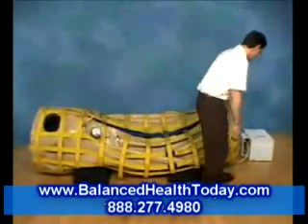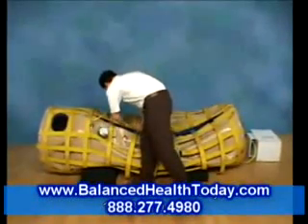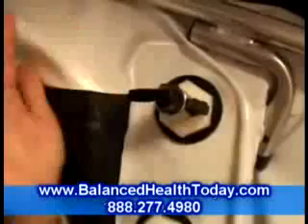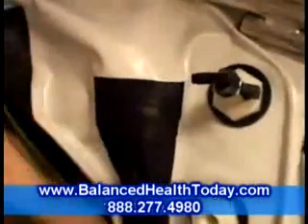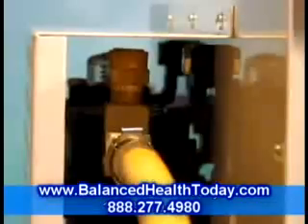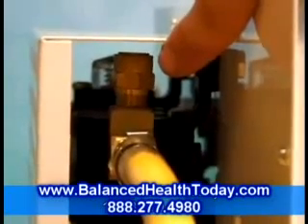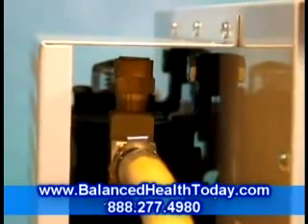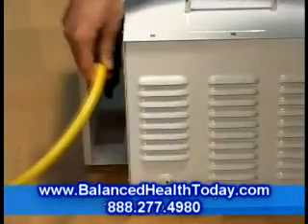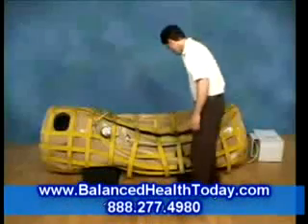Now let's do a final check of the air system. Turn the compressor on and feel for air coming out through the internal air valve. If this valve is open, you will feel a strong stream of air on your hands. If the valve is not all the way open, the airflow will be weak to non-existent and you will hear a louder than normal sound from the compressor — that's the compressor blow-off valve letting air escape when the air inlet valve is closed. If this happens, turn off the compressor and double-check the hose connections and make sure the internal air valve is in the open position.